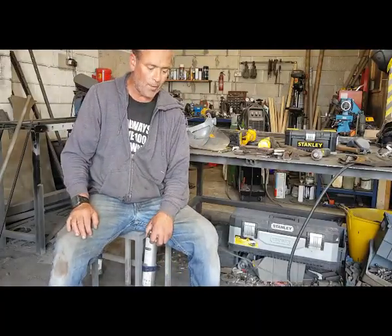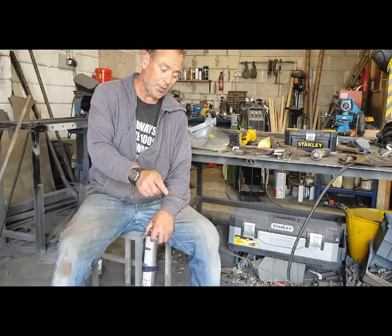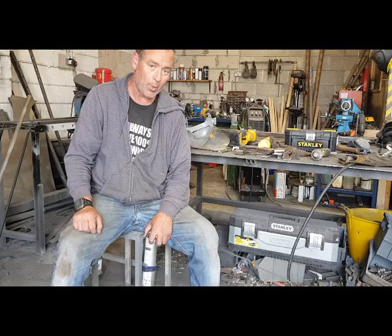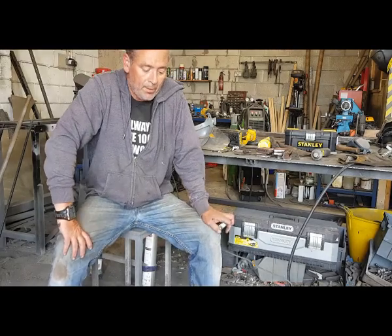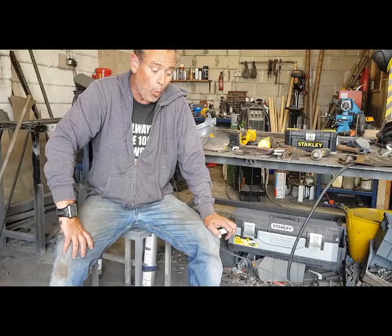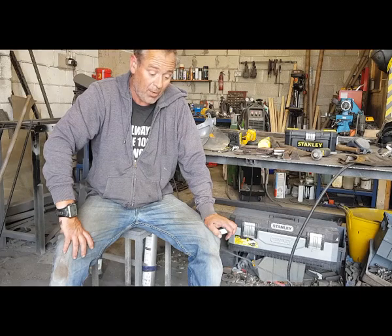As a rough rule of thumb: if it's taken you half an hour to melt down the cast iron, leave it in the sand for at least the same amount of time — half an hour, preferably double if you've got time. If you take it out too quickly it becomes very brittle and likely to crack. If you pour water on it, it may even crack straight away. If you leave it, it's still hard but it's weldable with cast iron rods.